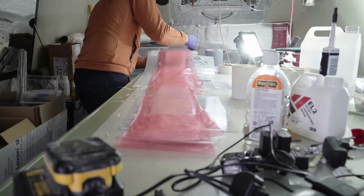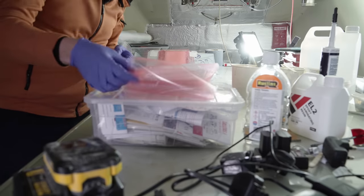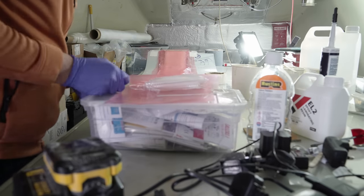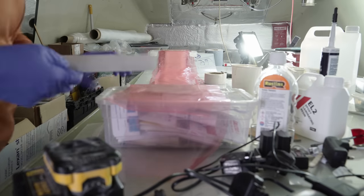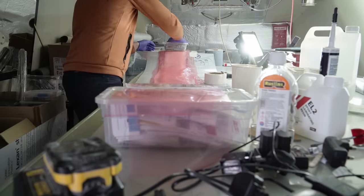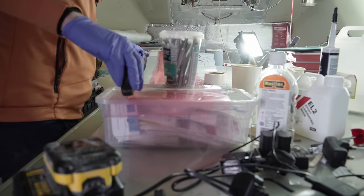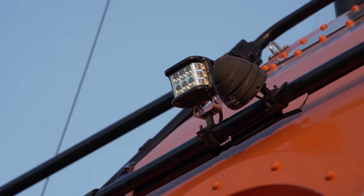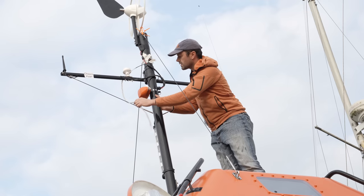It's the Slow Cure Resin Hardener — it takes a full day for the chemical reaction to complete, but you do end up with slightly better performance in return. I've actually started using the much thinner Infusion Epoxy Resin for some of these flat brush layups, as it wets out the fabrics more quickly and avoids any ill-advised tampering of normal resins by adding thinners. What a perfect opportunity to enjoy the increasingly balmy early summer days during the curing process.